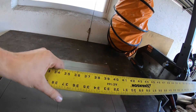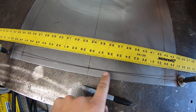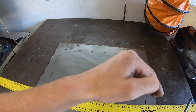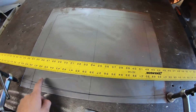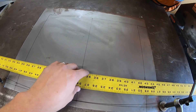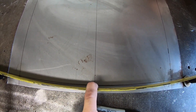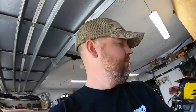Here's our template on the sheet metal. A little trick I've done before - I had to do a little radius on the back side because where the glass ends has a little arc to it. What I do is mark out where the radius needs to be - in this case it's about three-eighths of an inch on either side - then I take my clamps and use a straight edge on edge to get a nice even bow and mark it that way.